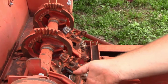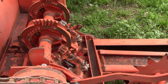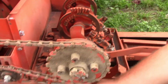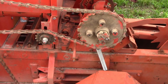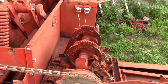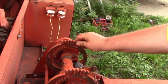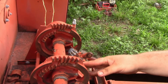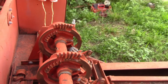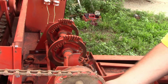So like there's a bearing here, you want to make sure it spins, but this one doesn't. It has stopped spinning. I don't know if you can see, but they have replaced the spring that pulls on the bale length arm. The knotters are looking okay. They're a little loose here, but that's okay. And that is actually quite loose, and I think it needs to be addressed. So that may be something we look at.